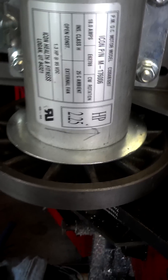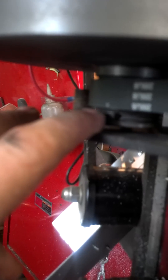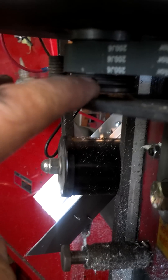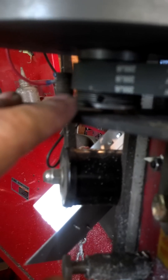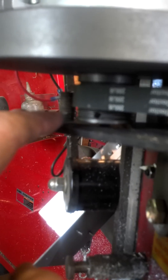In order for it to run backwards, this is a left-hand threaded shaft, so if I ran it backwards it would unthread. All I did is I went and drilled clear through, put a roll pin in there, tightened it up, red Loctite'd it, and added the roll pin. The chances of this shearing are slim to none, so now I can safely run it backwards.